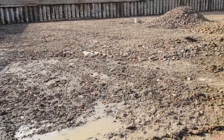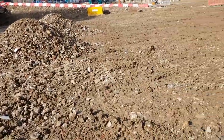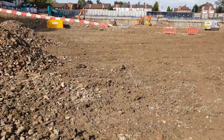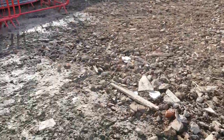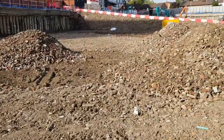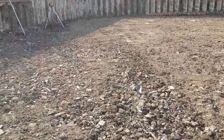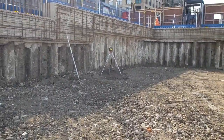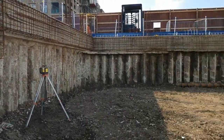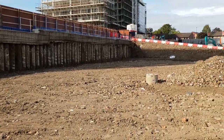I want to show you this — our company is also responsible for maintaining the pile mat. After heavy rain, look what we've got here: we had to stop works and scraped off around 50mm off the top, which had mixed the muck with our crush. We had to bring in fresh material just to top up that 50mm to get back to the proper level at the top of the pile mat. I set the laser up here again — thought I'd never come back here with it, but it can surprise you. That's why you keep your datum levels all the time — you never know when you'll need them again.